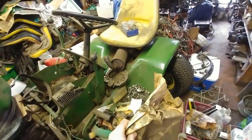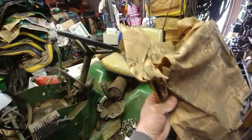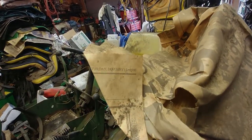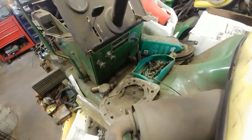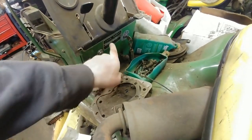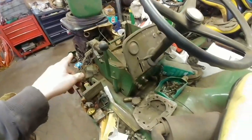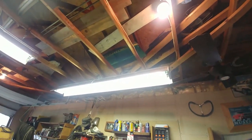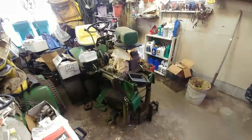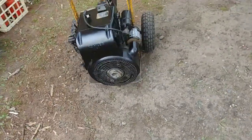The oil pan was wrapped up under the seat in that same 1996 newspaper, which confirms how long it's been sitting. Once I cleaned it out enough to reach the identification tag, I found I was way off on the series — it's actually a 140, not a 300. The tag reads T058H1, meaning one hydraulic hookup, probably a 12-horse Kohler, built right around 1968 to 1974. That also explains why there's a 140 hood up in the attic — it would belong to this tractor.